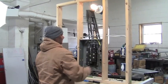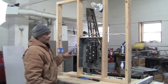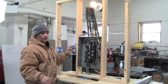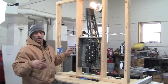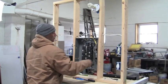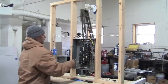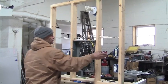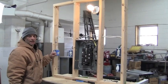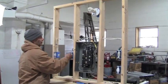Doesn't mean if it goes off you did it right — you've got to do a whole bunch of different combinations. And here's our four-way now, say down the hallway or somewhere else. You can honestly put any of these switches anywhere in the house you want. You can put one in the basement to turn an upstairs light off or on or whatever. So this is what we got — we can play around and do all different kinds of combinations, which is basically what you want to do. Because if all of a sudden you find out you turned it off on that side but now you can't turn it back on on this side, well, you've got something wrong. So make sure you do all that and have it right.